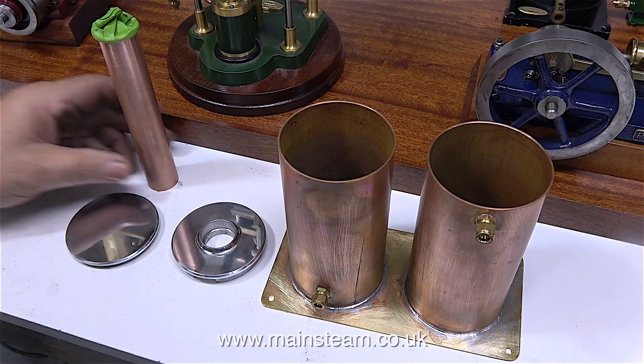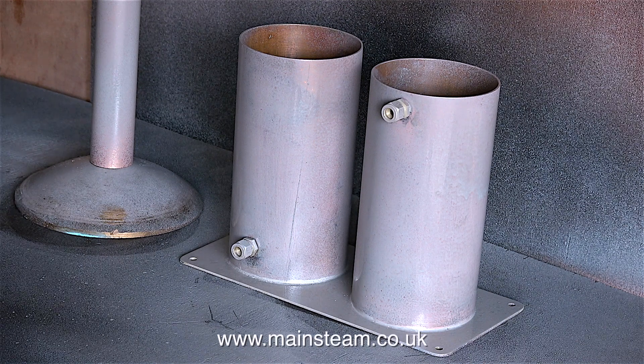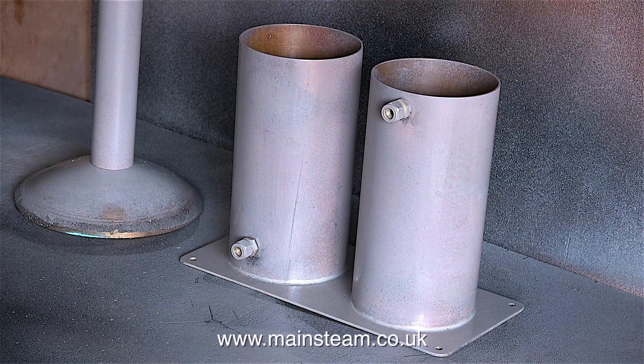And that's almost it for this episode. All the parts are ready for painting — not the top caps, they're just sat on the bench for effect. I found a lump of scrap brass in my scrap bin to support the chimney, and I'm spraying the parts using Precision Paints etch primer. I really do like this stuff, and best of all it works. You must be able to see the metal through the paint, which means the etch primer gets plenty of oxygen to do its job. The instruction leaflet tells me to wait 24 hours before overcoating, so I'm waiting 24 hours.